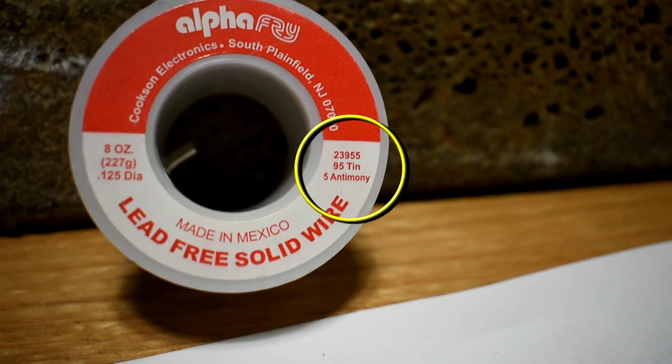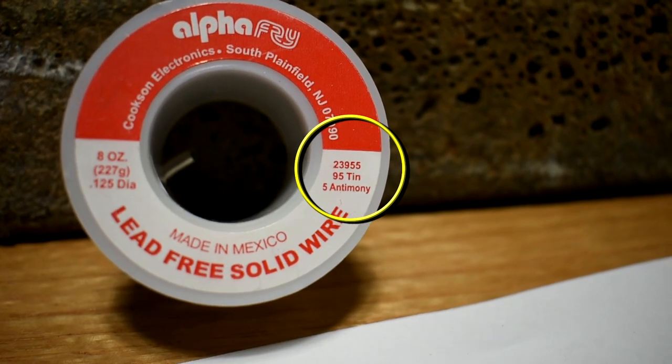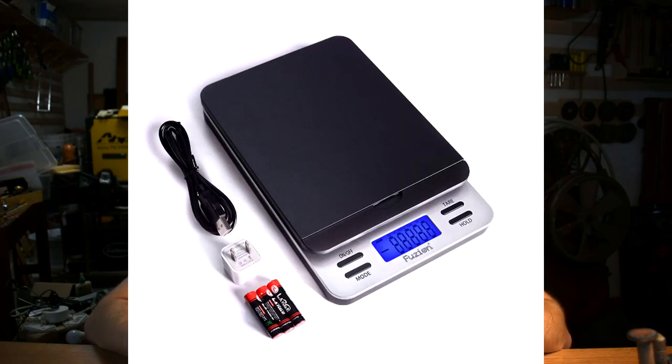And lastly, if you insist on making your own bronze, start with tin bronze. Get some copper. Most plumbing copper is mostly pure. All electrical copper is pretty pure. And then lead-free solder. Some lead-free solders are 95% tin. If it doesn't tell you on the thing what the alloy is, don't use it. Do like 90% copper, 10% tin. And when I say that, I mean by weight. Get a postage scale. I'll link one down below. Just a general measure in grams or something.